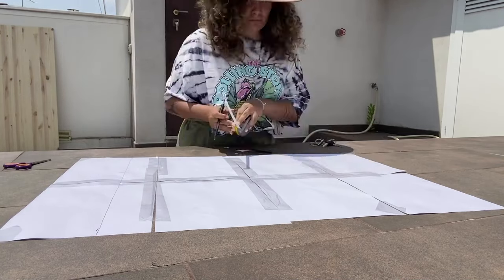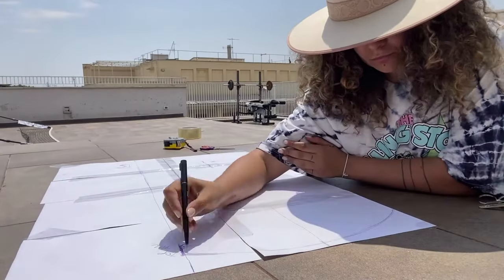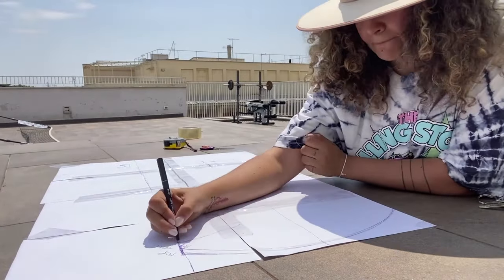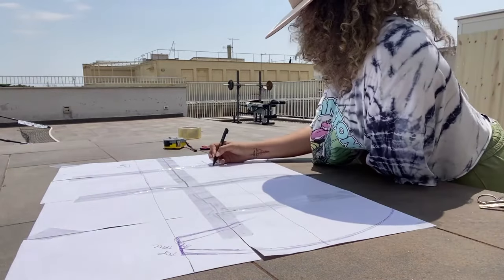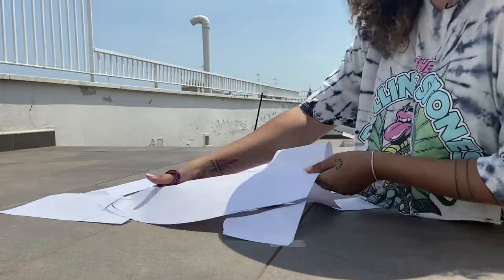On one side, I am gonna mark 39, and on the opposite direction, only half of the height, because two legs are gonna cross. At that point, 14.5, and by hand, you draw all the curves of the original leg. Let's go and cut it all away and use it as a stencil on our piece of wood.